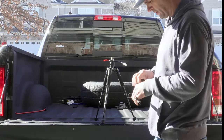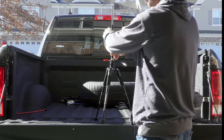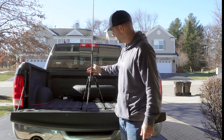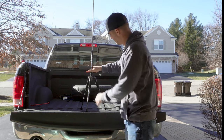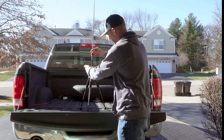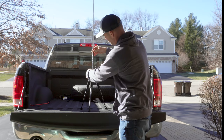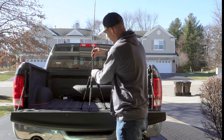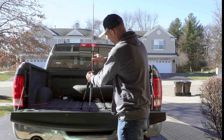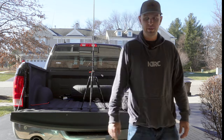I haven't had too much of a chance to test it, only a couple of times. All I have to do is screw in the antenna, plug in my coax, and then plug in my counterpoise. The reason I chose to put an Anderson Power Pole adapter on here is — yes, you could probably unscrew the antenna first and then unscrew the metal part to get to your counterpoise wires — but I think that's impractical when all you need is a quick release. Any barrel connector will do it.